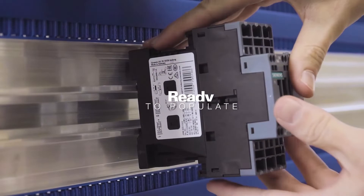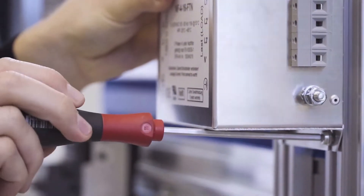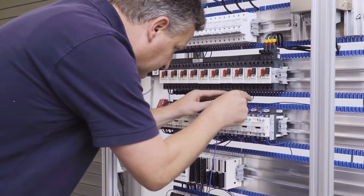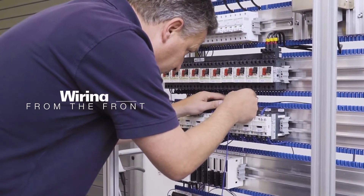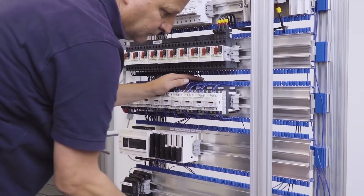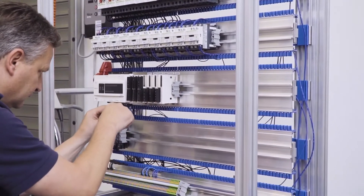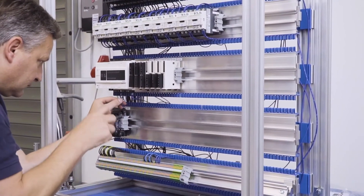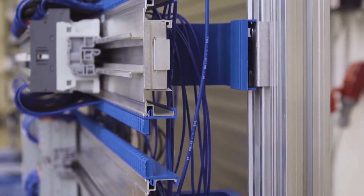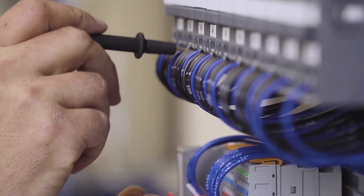Provisions are already made for DIN-mounted and screw-mounted devices — it's that simple. Easy access to the components' connection points makes wiring effortless. Wiring is done from the front; routing the wires is similar to the wire duct but without the constraint of the fill rate. The wires run horizontally in between the wiring combs, keeping the wires in line with the connection points.